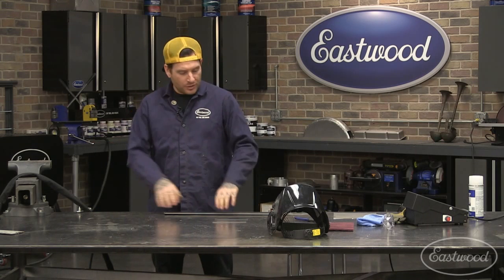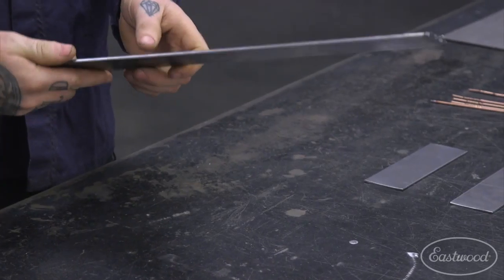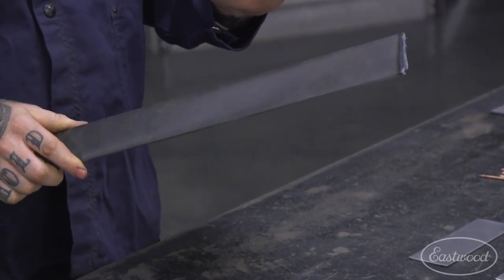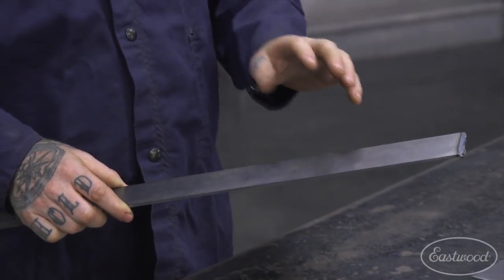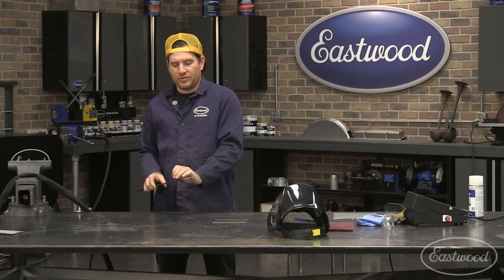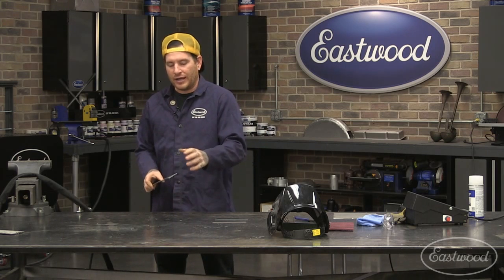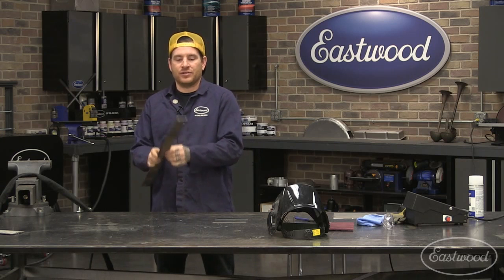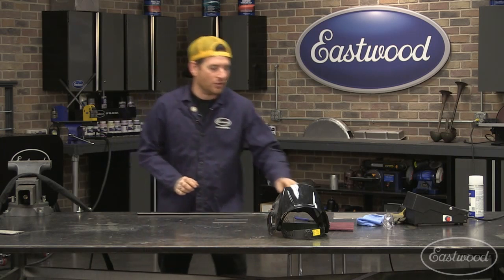With a MIG welder, this fresh piece of steel that we have here, that is 1/8 inch, would be completely okay to basically just wipe down and run with it. But with a TIG, you're going to find that the oils and contaminants that are in the surface, there is some slight corrosion that just happens from being out in the atmosphere. It will cause some corrosion that you need to get off there, and you will find light contaminants in your workpiece.